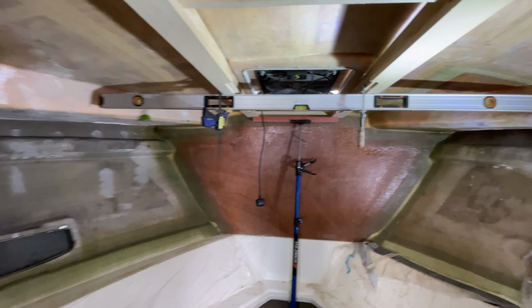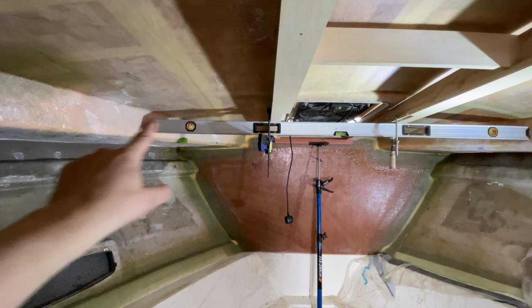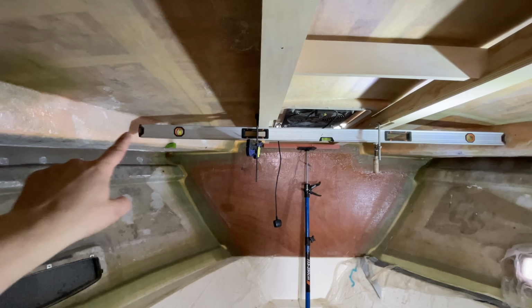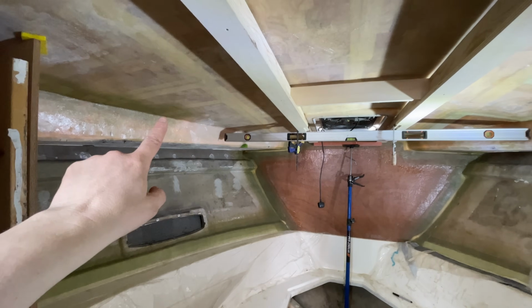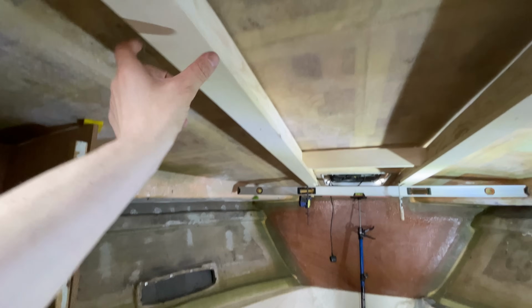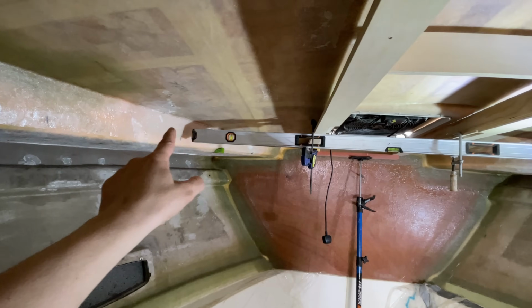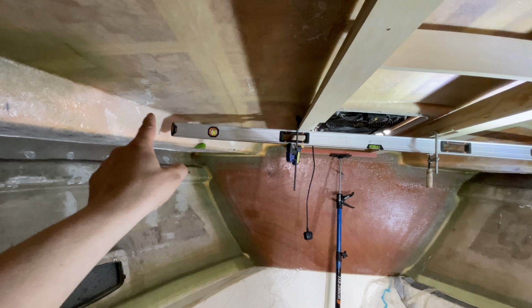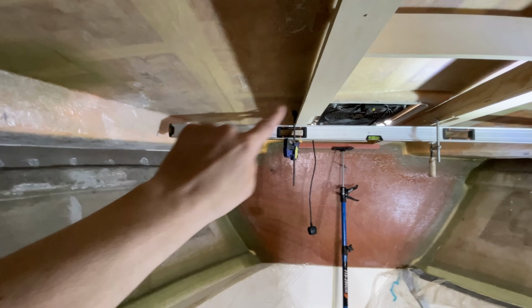so that's great. So next what we're going to do is cut some horizontal support sort of beams, if you like. So we've got to have three. We've got one where that spirit level is at the moment, we've got one a little bit further back at 600, and another one here at 1200, and then again that will be T-shaped like this. We've just got to scribe it to the underside of the deck. So it's a little bit of an organic shape, that. So what we'll do is we'll cut a piece of wood and then we'll use the scriber and get that scribed properly.